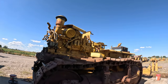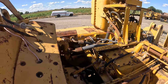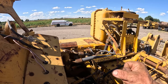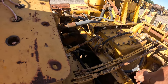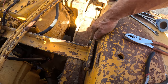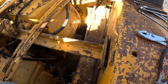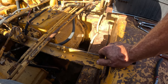It's been kind of interesting because I found that practically every bolt everywhere I don't even have to hardly push. Especially the lines and stuff - I use those anchor clamps, put the wrench on there and get ready to bear down and they just go. Nothing was tight. They like to use a lot of bailing wire everywhere to hold up wires. Here's the two bolts that have to come out - there's a couple spacers in there, doesn't look right. Usually there's shims but with those big spacers and nothing on the other side, it's pushed clear over that way, so things may not be lined up correctly.